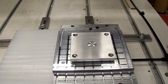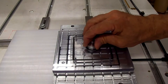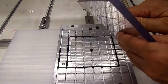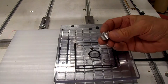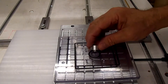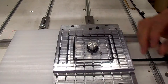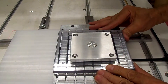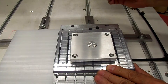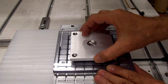I'm getting ready to cut the groove in here for the gasket to go between the two plates. In order to do that, I went ahead and made a little centering pin on the lathe to fit into the plexiglass plate to center this plate. So I've got to make sure my grooving bit is centered and then take it from there.